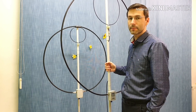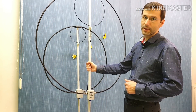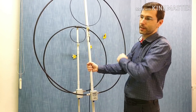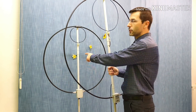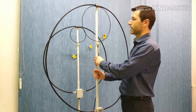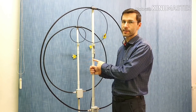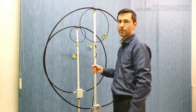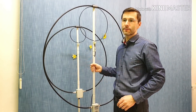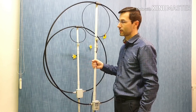This is the main difference. Difference number two is dimensions. As you can see, the 4th version is a much larger antenna. The diameter of the main loop antenna is 1 meter wide. The 3rd version has a 70 centimeter diameter. Other dimensions have also changed, like the small coupling loop. The coupling loop in the 4th version is 34 centimeters in diameter, while this one has only 18.5 centimeters in diameter.